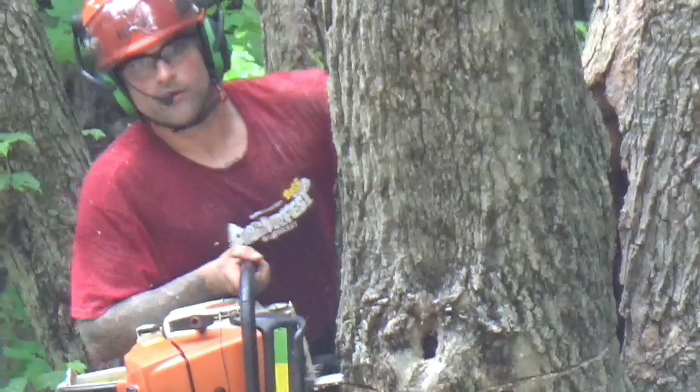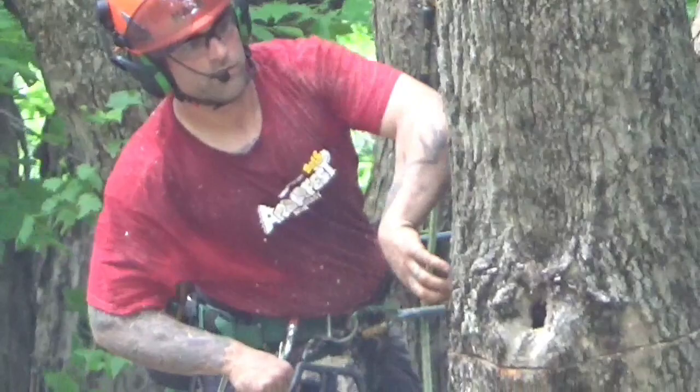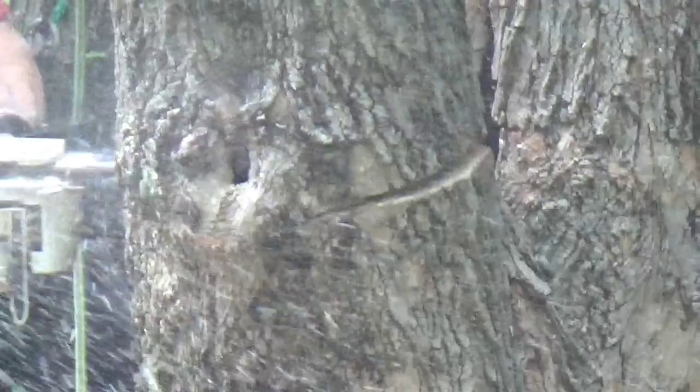He just wants to get a second set of eyes to make sure the cut is good. It's a really good idea to incorporate crew members you can trust if you can't see all the way through — ask, 'Is that cut all the way through on that side, or did they meet?' That way he doesn't have to fight to get around the piece; he wants to be in a good work position. You also have to consider where the movement might go, and you don't want your body to be there when it happens. Think about where you want to be when you finish your cut — and where you don't want to be.